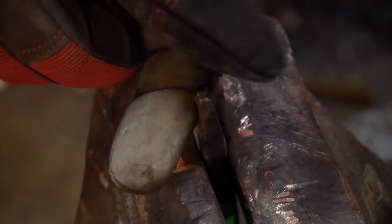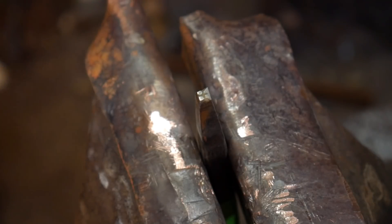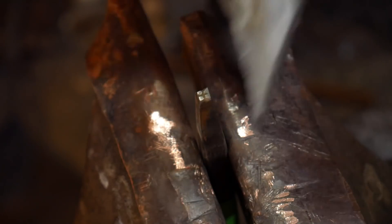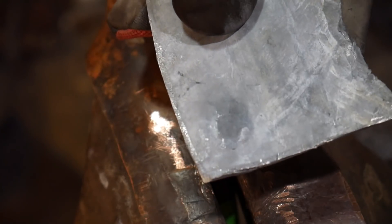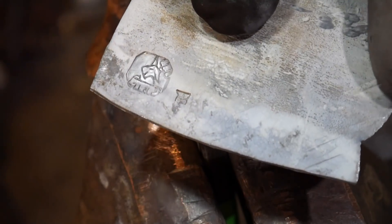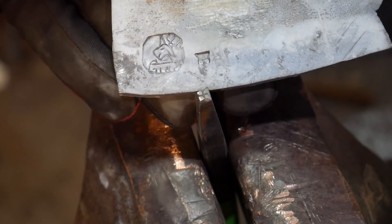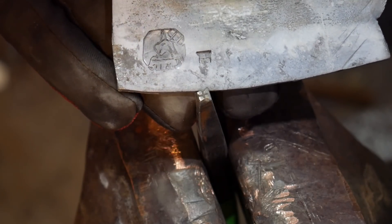Here's my own personal touch mark. As you can see, this is quite a bit smaller — a little anvil with a cross in the center of it. It is my shop logo. Now I'm just going to find a place right next to the one I just did and tap it right on down. Obviously this isn't going to take as much tapping because it's a much smaller touch mark. You can see very quickly how you can check and see how the outline is going to perform when it's actually stamped into your material.